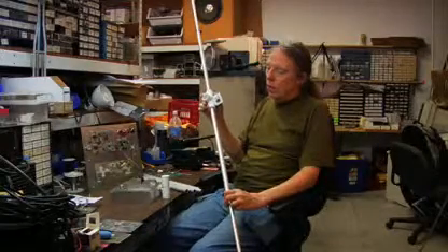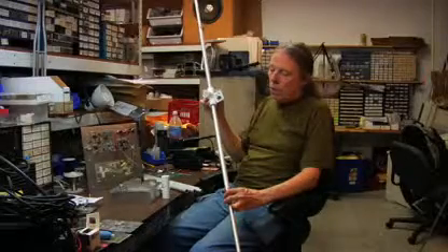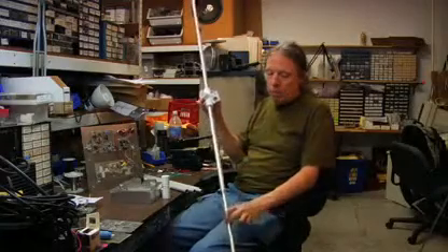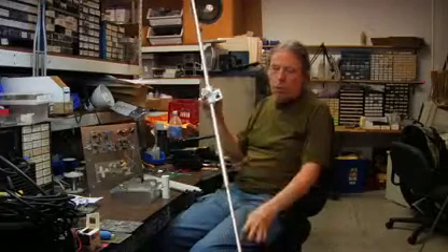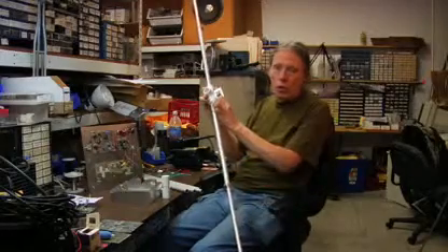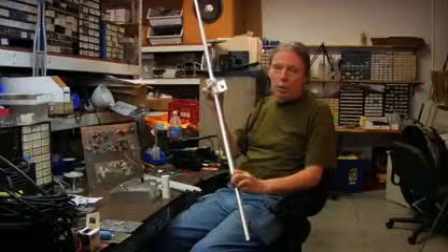Proceeding on to a few details regarding this dipole antenna. The dipole antenna is your basic fundamental antenna used for broadcasting. It comes in various forms and configurations, but this is the most basic form. The length of the elements is a function of the frequency: the lower the frequency, the longer the element length; the higher the frequency, the shorter the element length. So basically we adjust the total length to tune it to a specific frequency that's been chosen.